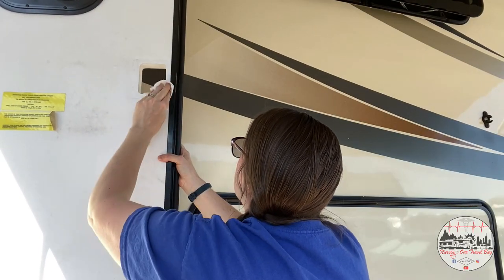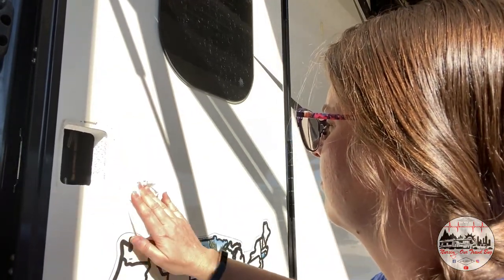Now for the big upgrade. Before I actually install the plates into my door frame, I want to make sure that I clean that surface really, really well. As you can see, some dust and grime has gotten under the old latch over the years, so we want to start with a nice, smooth, clean surface. There's that foam cover — all you do is peel off the backing and place it, superimposed with the hole. The manufacturer recommends that you stick the entire pad down first, then pop the extra piece off so you don't have to worry about any stretching or it not laying perfectly flat. We've now got our little foam padding installed.